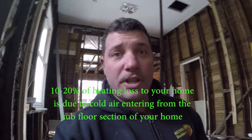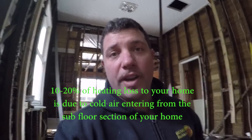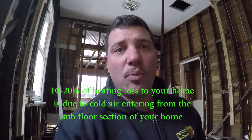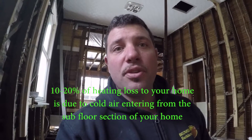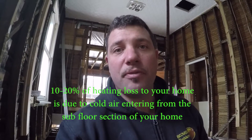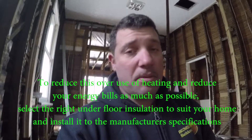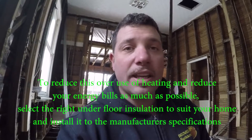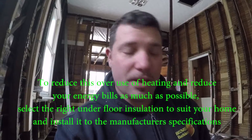This one's directed to you. We do underfloor insulation on almost all of our jobs now. It is one of the best ways, whilst we've got the floor up, to utilise the area that we've got and stop drafts coming up between floorboards or leaking energy in different places. It's helping create an energy efficient home.